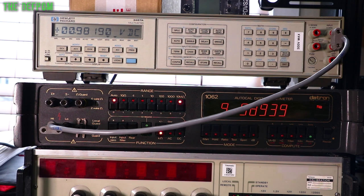So if you've got, say, like in my example, I'm putting in, going from memory, I think it's 100k in one case. Is it 1k or 10k, depending on which ratio I'm using, either 10 to 1 or 100 to 1. So if it says 100k onto the inputs, shoving 10 megohms across 100k changes the 100k reading by quite a bit. It changes it by about 9%. That gives you a wrong reading. You can compensate for it. You can just tune it and allow for that to work. That's fine. You can do it. But you have to know for it.